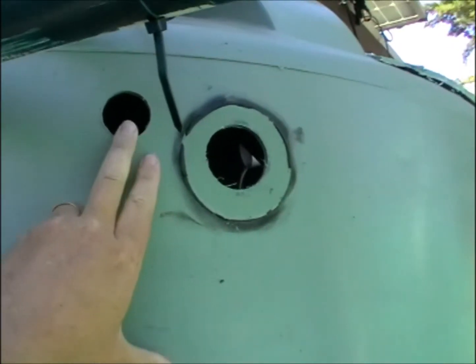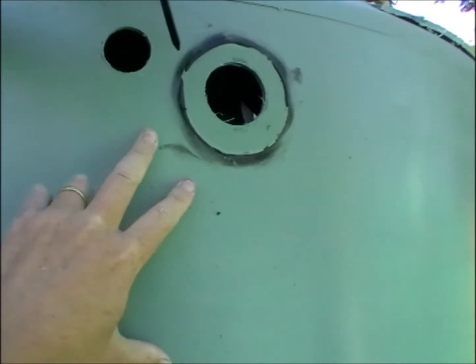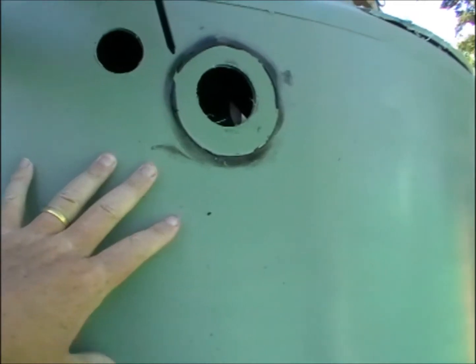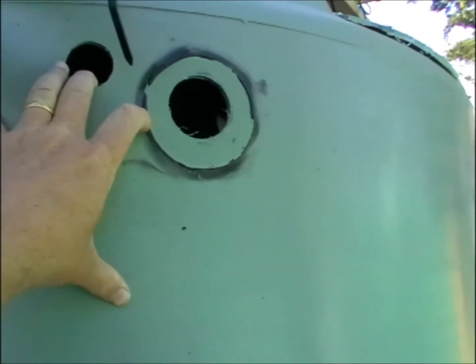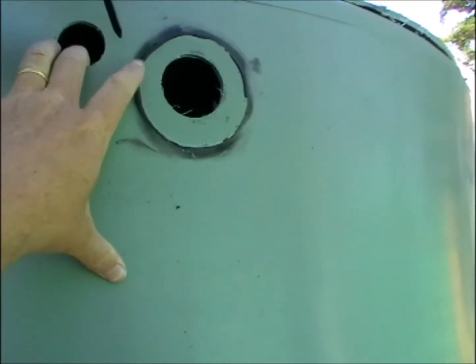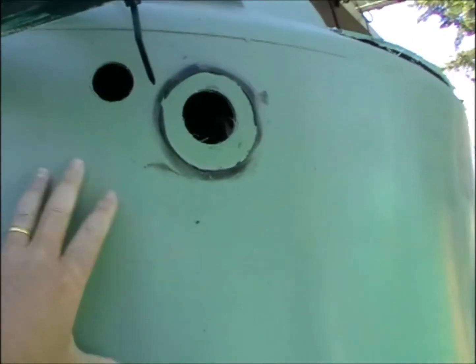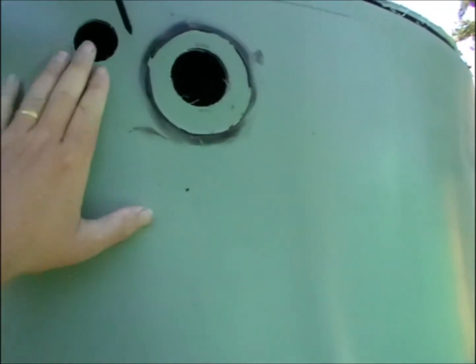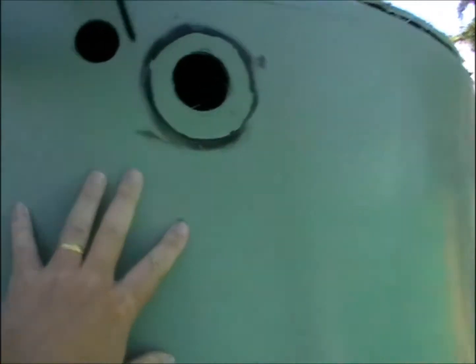This system was running a three and a half thousand litre an hour pump coming out of a sump into the tank, and I've upgraded to a nine thousand litre an hour DC pump, but it's only running at about four and a half thousand. I just wanted a bit more flow - get everything happening faster, gives it more power skimming the top and the bottom of the tank.